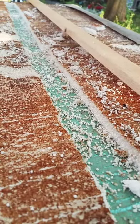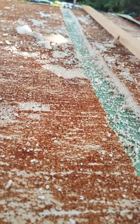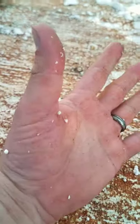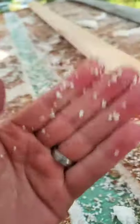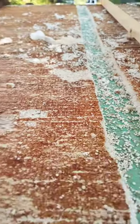Once I get all the joists and stuff in place, I'll start ripping out at least the most wet sections. The stuff in the back isn't wet, but I think all the way to about here is probably going to have to be done. It just took on a lot of water in May. Even feeling this now, you can feel it's still really wet. Some of the pieces are very heavy — it's just retaining water, which is making the weight for the roof sag. The lowest points are the wettest points.